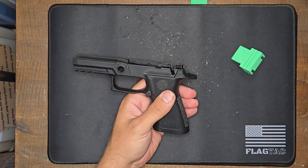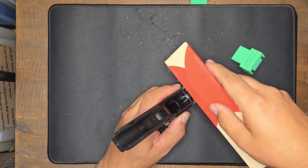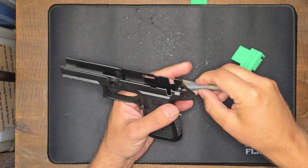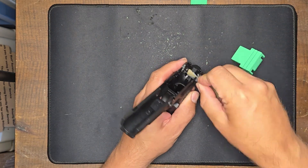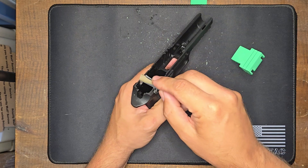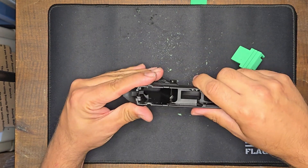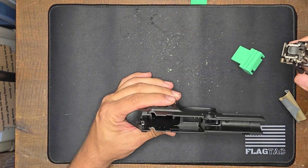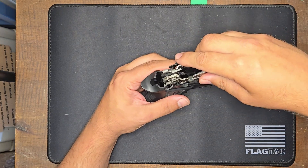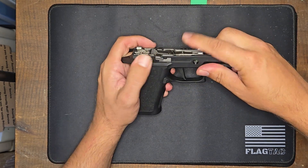It's got a little bit of fuzz on it, so we're just going to take our sandpaper and go in there and clean that up real quick — it doesn't take a lot. Then I've got a little piece of 320 grit here. I just like to roll it up, put it in there, and just tidy that up a little bit. We'll check it for fitment — take my FCU, blow all that stuff out so we don't want bits of plastic in our FCU. Nice.